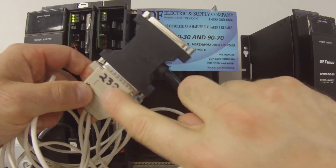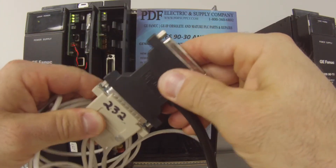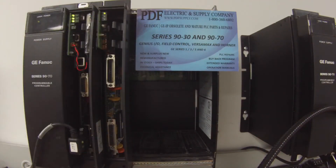I'm going to use port one for the first part of the test, and I'm just going to check that these two ports are working. Go to Target, Online Commands, Clear, and you want to clear the Controller Fault Table and I/O Fault Table in the processor. This is because the processor has previous information that you want to clear out so that you can make room for this test.